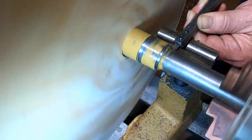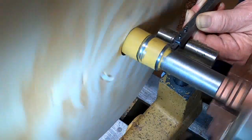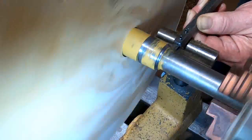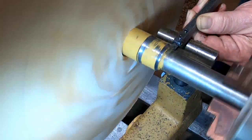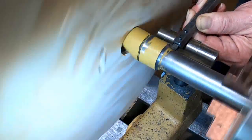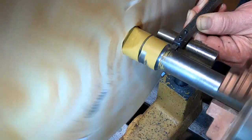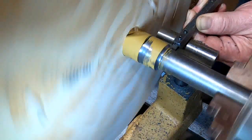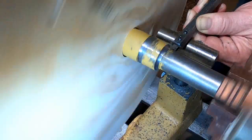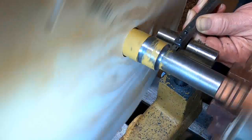Here you see where I'm coming in on the side — this changed everything actually. It allowed me to make the tool bite. Since it was continuously cutting, it didn't push me away even though the side cut would vary with the casting. As I worked it down in small increments, this actually worked. I could work it down to near the diameter in one portion and then start working on the next little iteration of length.